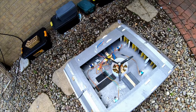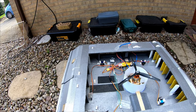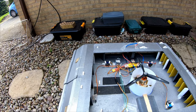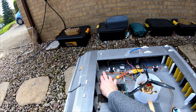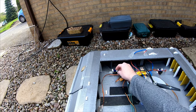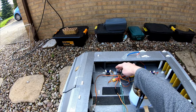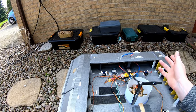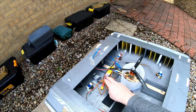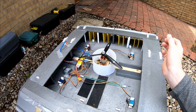There's nothing really in here — it is just hollow. I've got my servo mounts, and that part is up on my Thingiverse if anybody wants it. My pull rods are 1.2mm piano wire, with a little electrical terminal block there which is really good for adjustment. My receiver is somewhat taped up — basically water protection or partial water protection. Same with my ESC, it's somewhat taped up. Rubber band to secure the battery, and that hook is also on my Thingiverse.